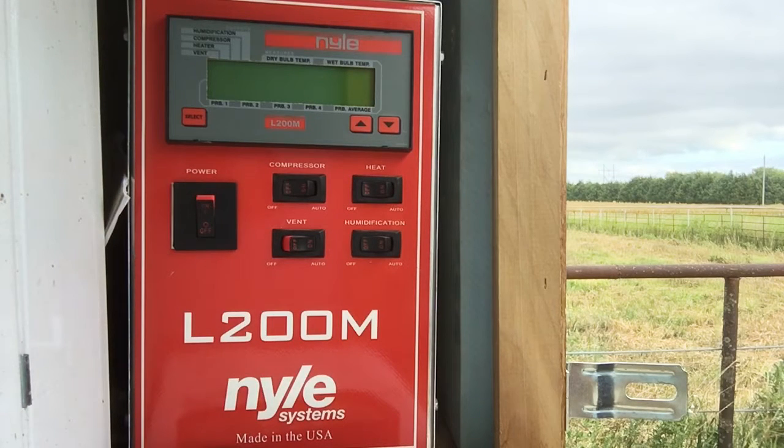But sometimes, especially with walnut, it can stall out around 13 to 15%. Sometimes it'll just quit giving up water, and so you have to crank the temperature up, and that'll kind of bust the humidity loose, and it'll start flowing again. So the compressor gets shut off during that cycle. The auxiliary heater usually only runs after the initial loading period, and then during the sterilization cycle, as the dehumidifier produces enough heat to hold the temperature where it needs to be.